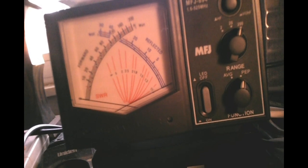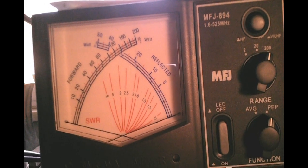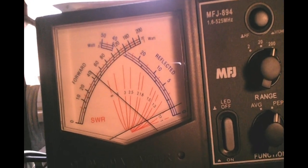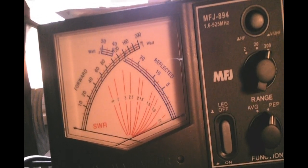Let's take a look at what happens when we have this radio connected to a battery that is fully charged. It's the biggest deep cycle marine battery that Walmart sells — about 100 bucks. We're going directly into it and it is fully charged. Let's take a look at what happens when we actually transmit the tuning signal. And there you go — we're not even making 50 watts. We're at about 46 or so. I mean, that's pretty poor. You're really not very happy here.